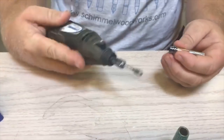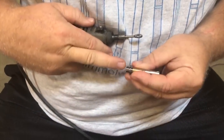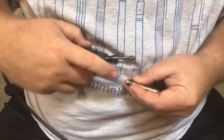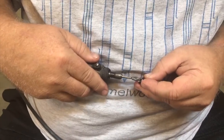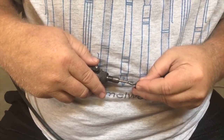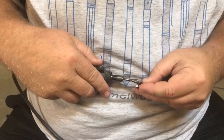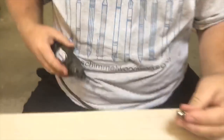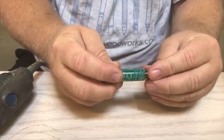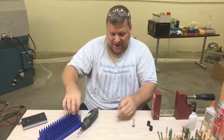To avoid that, I take my carbide burr — I hold it against my body for stability — and I'm just taking off the plating off the inside of the part. I stay back a little ways and just grind away that plating. I want this to fit in about halfway when I press it in. That's perfect — I've got a little bit of press room but I've taken away the bulk that would push out too much and crack the blank. I'll do that on both sides.